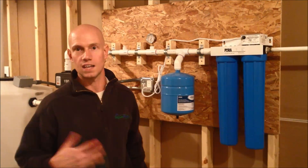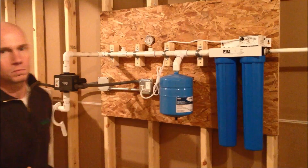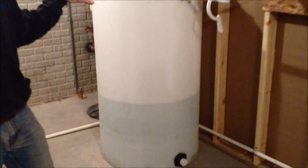So it's just using drain water to flush the toilets — out of the showers, but not out of the sinks. We avoided the sinks due to the fact that food particles and stuff like that would help the filter clog up quicker. But we have multiple replacement filters inside there as well as chlorine tablets in order to keep the water sterilized before it even goes back into the pump system.